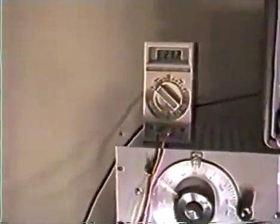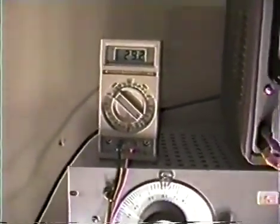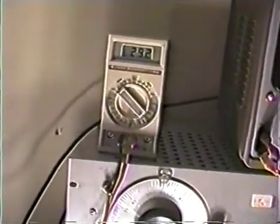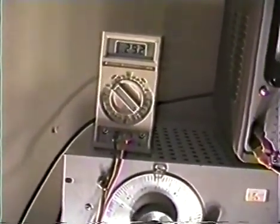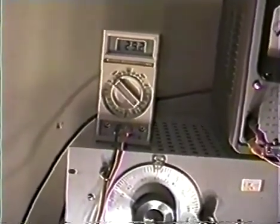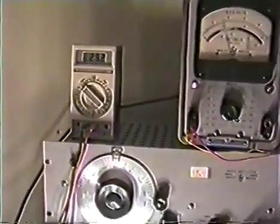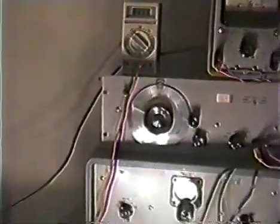And if we close up on our little meter here, we'll see that now we're drawing only 29.2 microamperes. We're still drawing about 10 volts, oscillating between 9.5 and 10 volts for the input of the grid of the vacuum triode, which is that little box right there behind the brightly lit 100 watt bulbs.